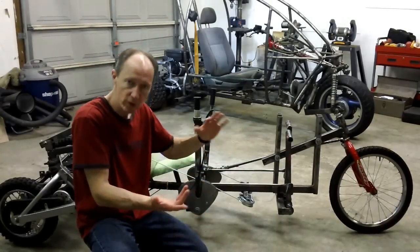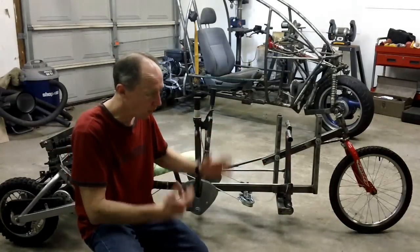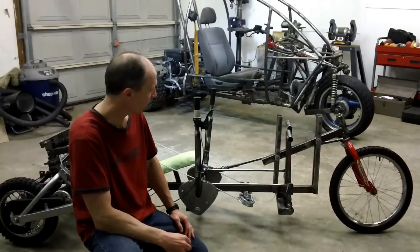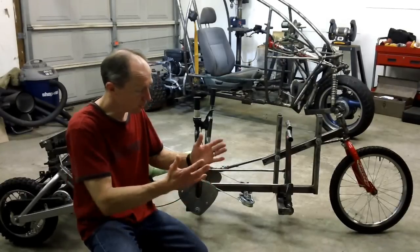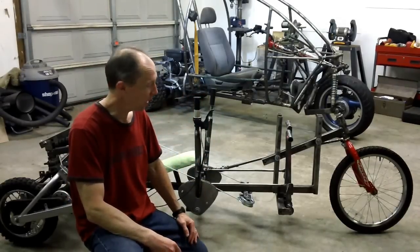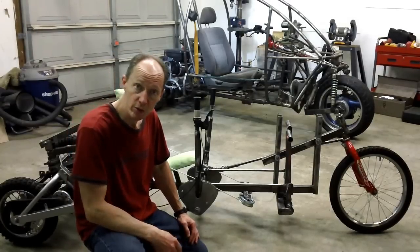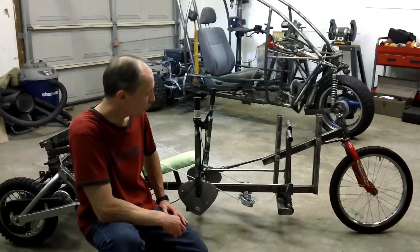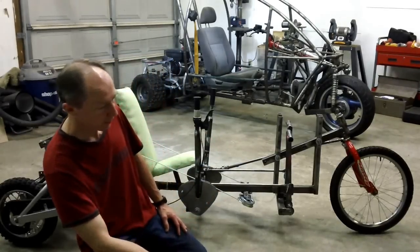Now you could do 4 wheels tilting, or 3. Why go 3? Well, it's less rolling resistance, less weight, and it's a simpler design, and thus 3 wheels can get the job done. Having 3 wheels gives you stability, so that when you get to a stop, you don't have to put your feet down, so you can have an enclosed vehicle, and that can be a huge benefit. There's several motorcycles and scooters that have come out with 2 wheels in the front. That gives you better stability and handling. Having 2 wheels on the ground can really be a huge benefit right there.